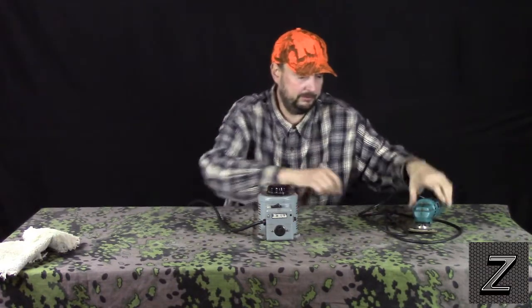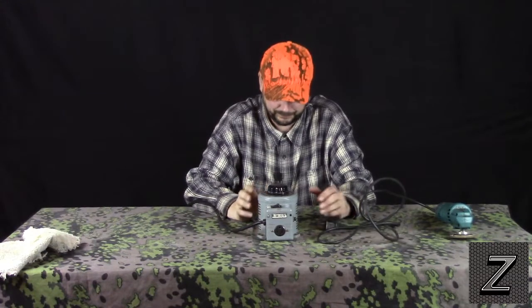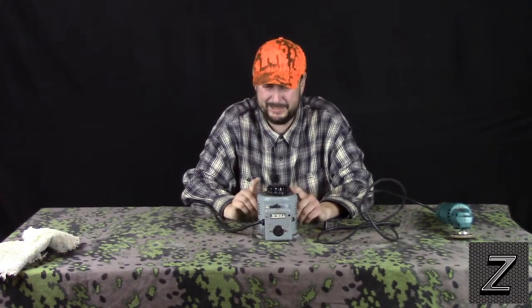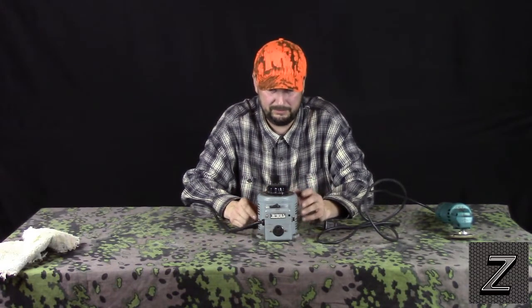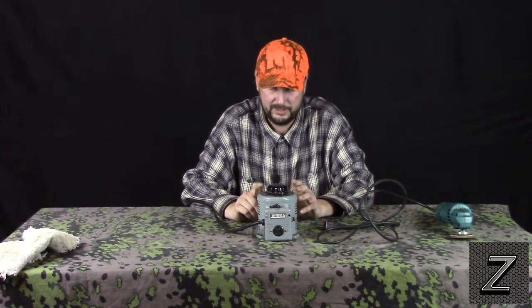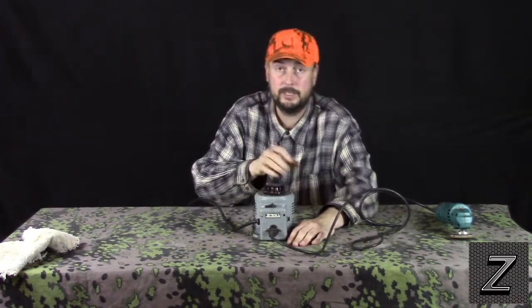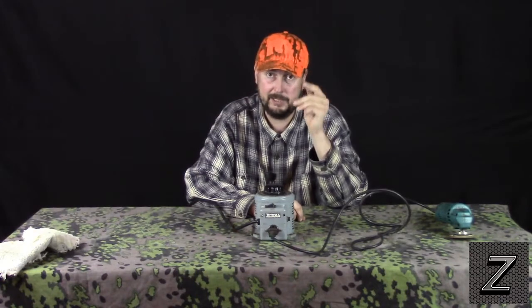The main reason to go this route: number one, you can use this with pretty much any of your power tools. Unless you get a really big one — which gets expensive — you're probably not going to want to try to control a drill press with it. The nice thing about drill presses and big stuff is they usually have different pulleys to adjust speeds. This is going to be more for your drills, sanders, and grinding wheels. And here's another use: got a grinding wheel? Say you get a honing stone for it — you don't want the thing running at full speed if you're trying to sharpen a knife. Using this, you can turn it down to about half or quarter speed and you'll sharpen that knife without destroying it.